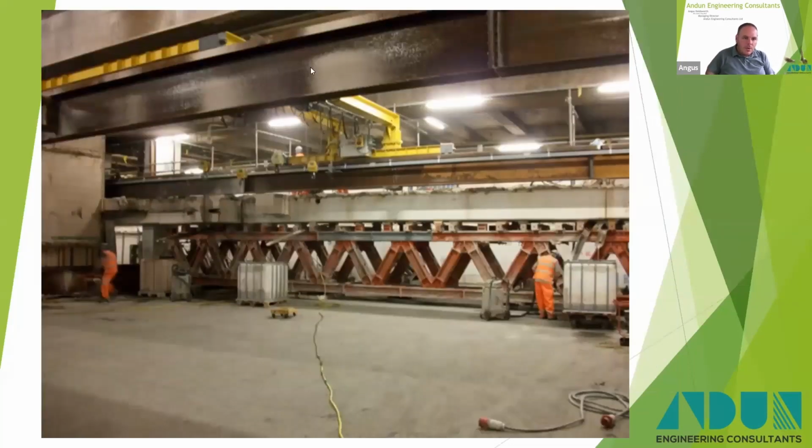So crane rails themselves were fairly hefty fabricated sections. They weren't that hefty, but they obviously did the job. There's some quite large spans, as you can see there. And we were talking about lifting 10-ton lumps. By the time that's got all the appropriate factors on it, it ends up being quite an onerous load that you've got to design the crane, the structural design of the crane, which we did.